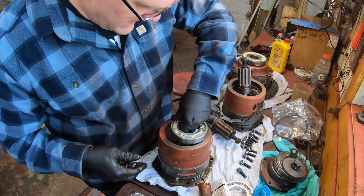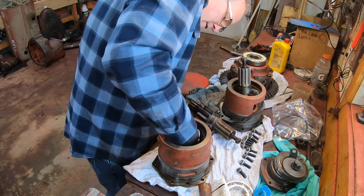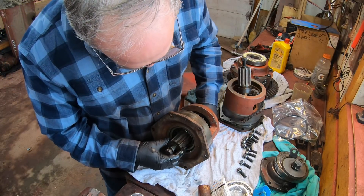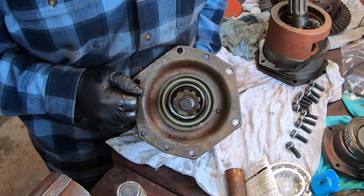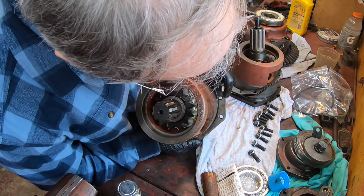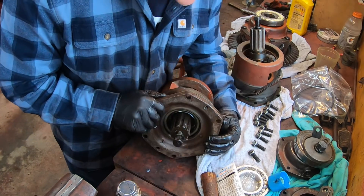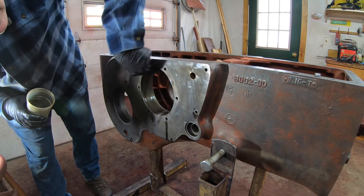Got a new bearing that goes in the housing here—just the outer bearing of the assembly. It should pretty much just slip in, it's not a real tight fit, but get it straight and then the pinion shaft slides in. This is where the brake drum goes on; the brake drum actually makes the seal here, and this is the bolt that holds the brake drum tight. And of course we can't forget the shims—these shims do have an orientation. There are little slots that go in the puller holes; you can thread bolts in to push them out from the case if needed, but I didn't need to do that in disassembly. We'll lube up the bore it goes into so the sealing ring doesn't catch and tear. This gap opening goes toward the back to drive the bull gears.